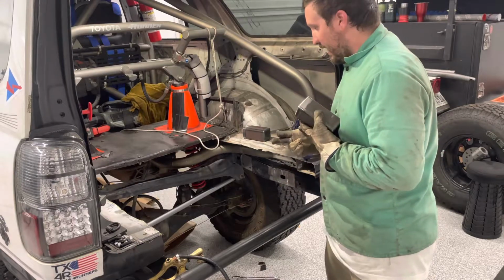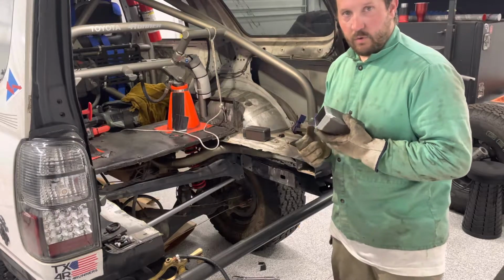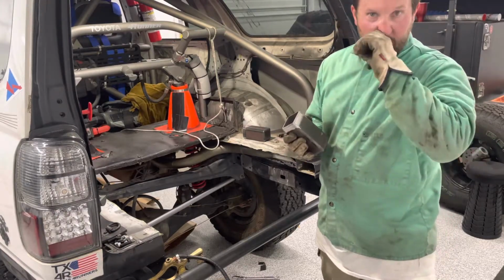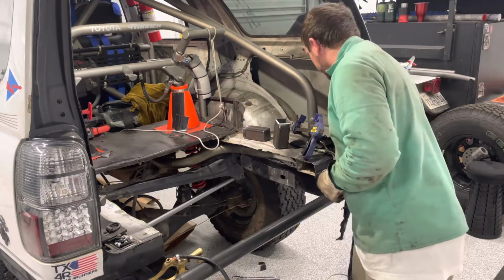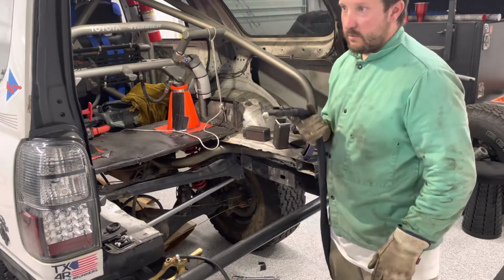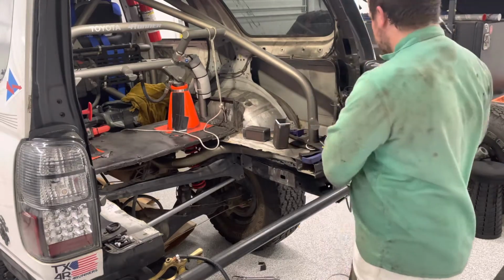Three things that I'm going to need for this work. One of them, the parts. We call these the work pieces or the base metal. The other one is the welding equipment. In this case, we are going to be TIG welding right here. We're probably going to be welding around 130 to 150 amps.